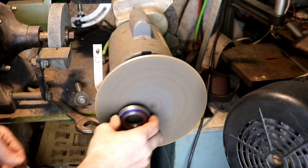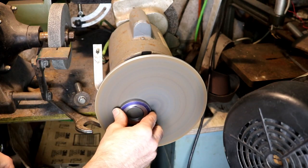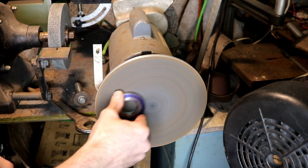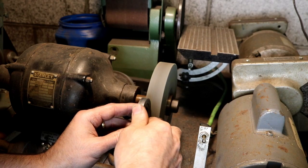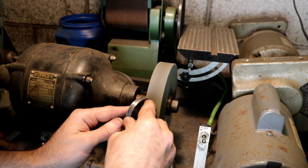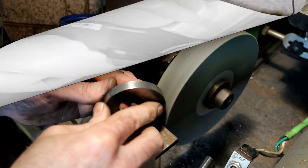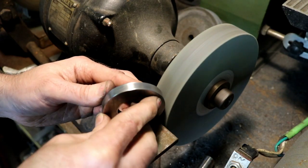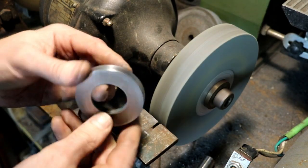Here's a tool I definitely don't regret building — just a quick little build I did in less than a day. It's an 8-inch disc that I stick sticky sandpaper to and I use it all the time. Here I'm just deburring the part a little farther, giving it a better finish with the gray scotch brite wheel. These were a gift from a viewer and when I wear these out I'll be buying more because they take all the work out of getting the part finished.